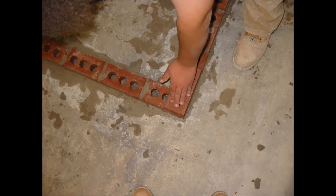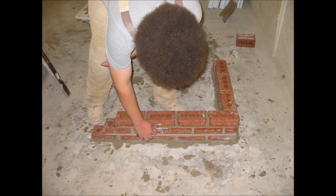This is called pointing the corner. In this picture I'm using a cylindrical striker to strike the corners to compress the mortar and all the mortar joints, which makes sure moisture cannot seep into the crevices, keeping it lasting a lot longer than it would if you did not strike it.